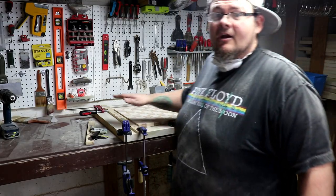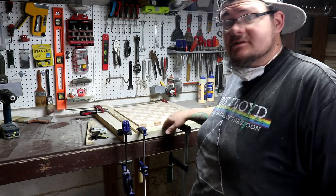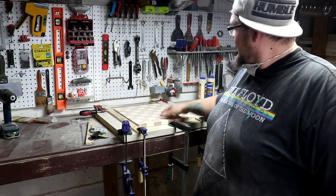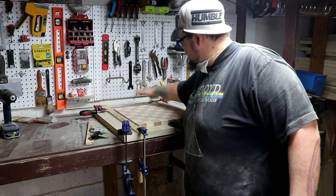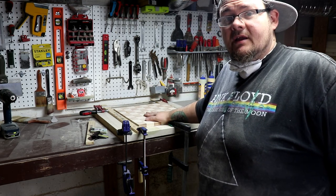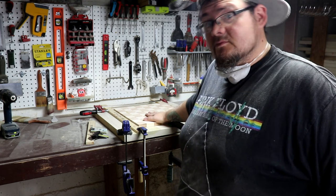Got our flattening board all flattened out — it took about a good 30 minutes, it wasn't exactly easy, but I got it done. It's nice and flat and square now. We have the chessboard clamped onto that, that clamped to the workstation with two clamps, and then the chessboard clamped to the board with two pieces of wood and three clamps — two holding it down, one holding it together. That board's not going anywhere. Now we can run our sanding sled on there and get it smooth on both sides, then we'll be ready for a danish oil rub and then we'll work on getting the frame built.